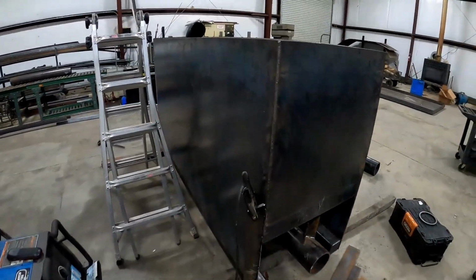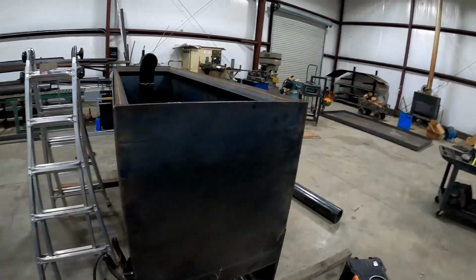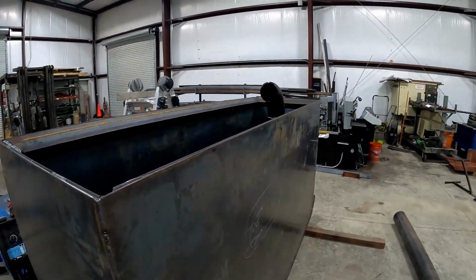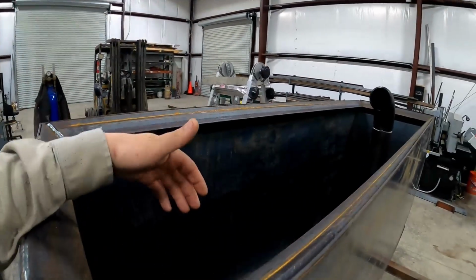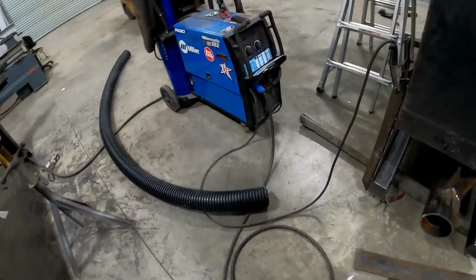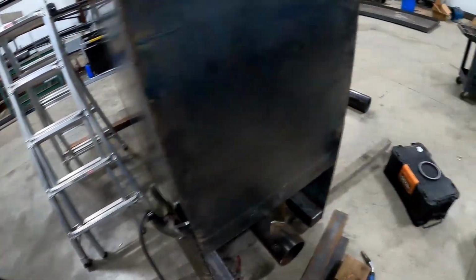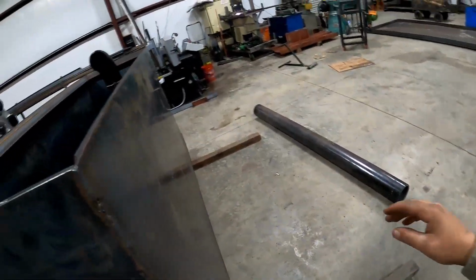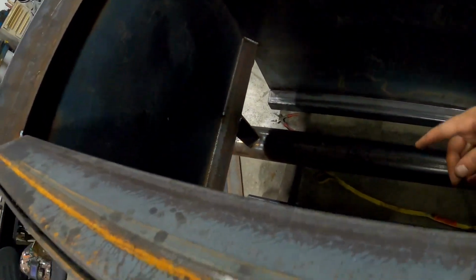All right, this is the progress on our rock slider box. So what this box is gonna do is there'll be a hopper up here that'll get full of stone, and then this 4-inch drain tile piping will feed through a section of the hopper here, which this pipe will penetrate through, feed around into this pipe and down, and then bury itself